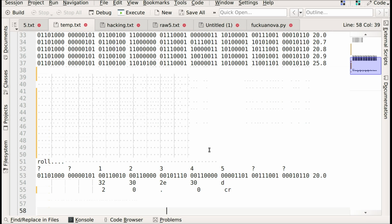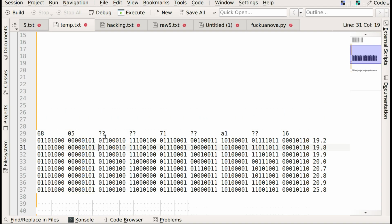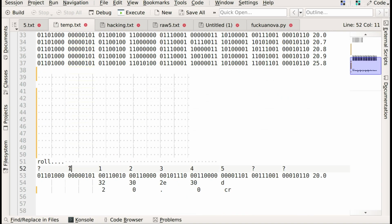The first thing I'll notice is the packet identifier, that ID, that command byte, the second byte that I thought originally. If you follow this scheme, this side would be 0. So that makes sense. If it's shifted by 0, then it's not obfuscated. Or if they've just decided not to roll that, then that also makes sense. So it made me pretty sure at that point that this was some sort of ID or something.